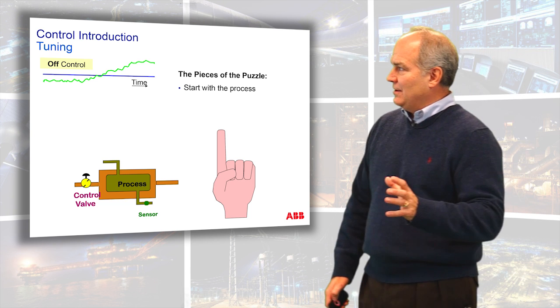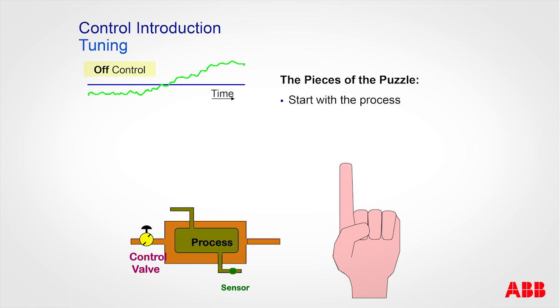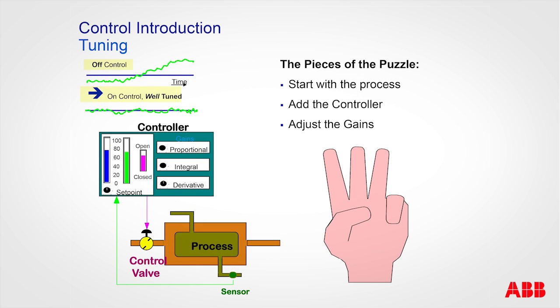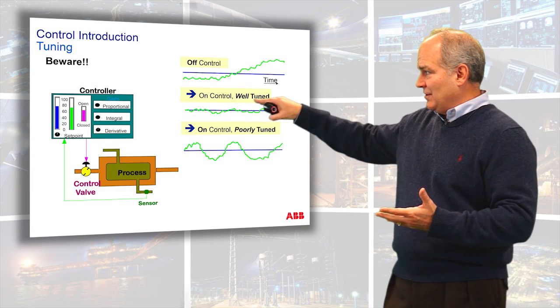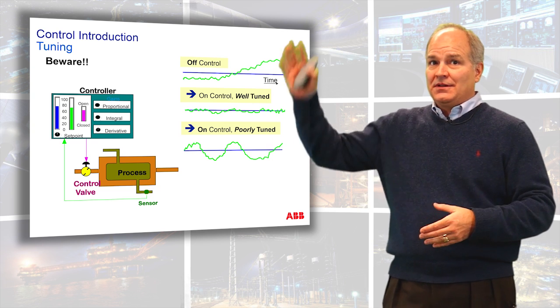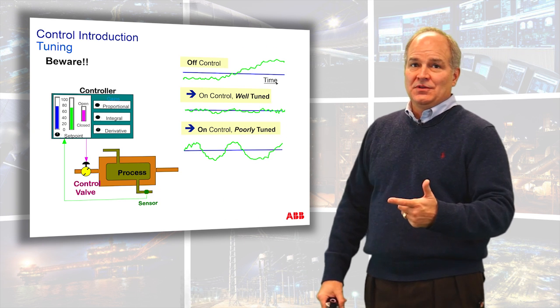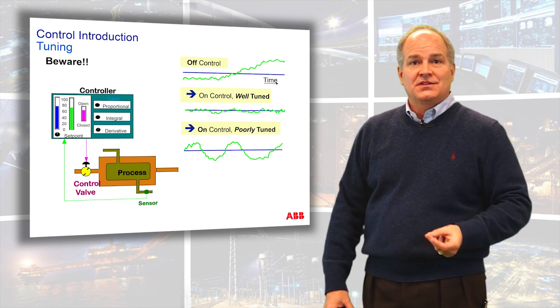How are we going to do it? We first have to understand our process — what's a valve, what's an actuator, what's a dynamic. We need to understand off-control fluctuations. Then we slap a controller on it — one that can take an input like a reference and convert it into an output. We put it on control and look at whether it got better on control versus off control, and adjust parameters to optimize control performance. If the loop is well tuned, you get good regulation between the set point and the measured value. If it's poorly tuned, it waves at you. We'll talk about how to measure all of this, how to come up with tuning parameters, and the validation step — did I actually get it? We're going to cover that in this series.